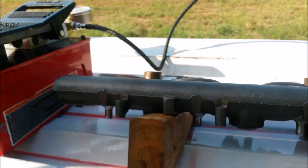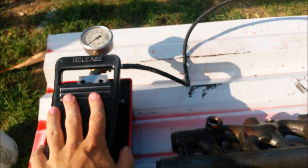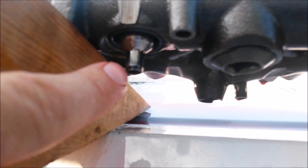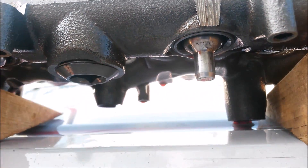We've got a high-pressure 10,000 psi hydraulic pump here. We're going to try to get that up to about 5,000 psi if we can. What we're looking for is to see how the oil either travels along — or does not travel along at all, in the case of ours — along the nipple cup body. Let me get a good shot and go ahead and turn on the pump.